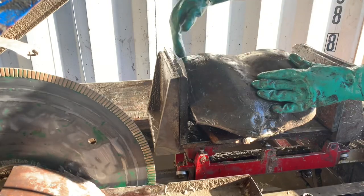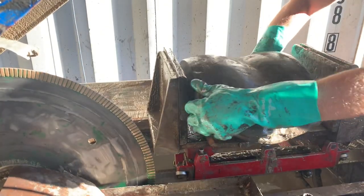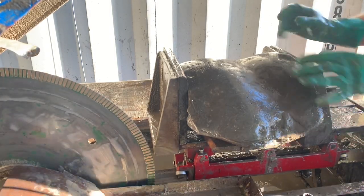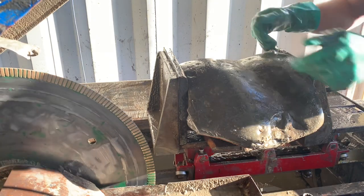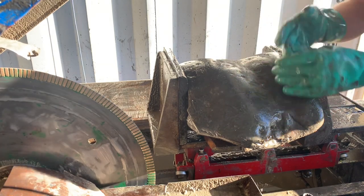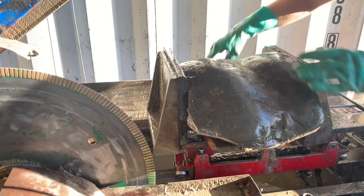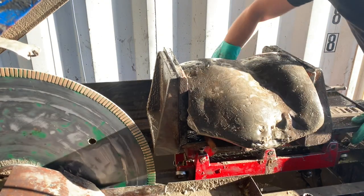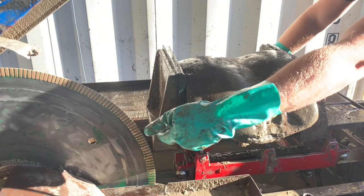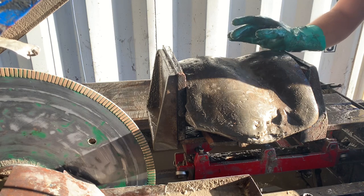But once you have the ends cut off of a rock you're working, you got the hardest part done, because from here, you'll be able to take your pass cuts without having to reclamp your stone. So the first goal of the process when you're starting with a rough rock is get it squared up. You want two cut faces to hold on to, and what you're gonna end up doing once you have your orientation chosen is you're gonna hang the stone out of the clamp and use a board over here to keep it back pressured. And that's gonna let you have a lot of rock hanging over here so that when you use your cross feed after your cut, you can pull the stone over like so. You can count your turns, or you can measure from here to here to determine your thickness, and then you take your next slice.